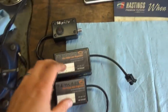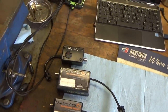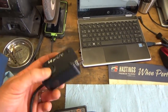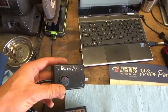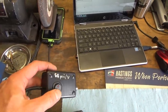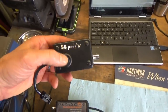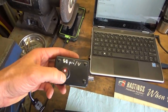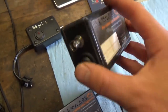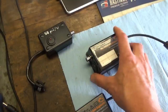Here is the evolution of the device — I've been building the pressure transducers for a few years now. This is the original prototype, still works great, I've modified it a few times, including a lit on/off switch. One drawback of this little guy is the box is so small I couldn't put the switch on the side, so if it's bouncing around in your trunk, the switch can actually be pushed and stay on and drain your battery. Version 2, I put the switch on the side by the BNC output, so even if something bumps up against it, the switch will be less likely to get bumped.